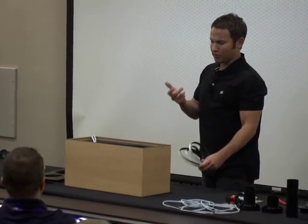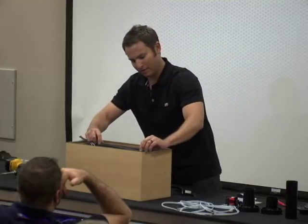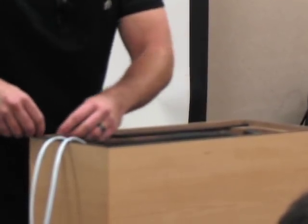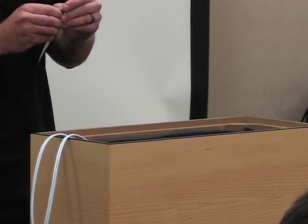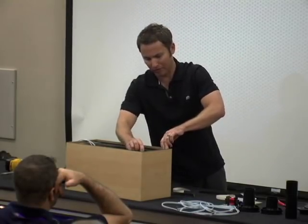Next step is to install the front baffle. We're going to use foam tape to seal it, though I like weather stripping caulk — load it in your caulk gun and it doesn't set. We need a good seal here for the baffle. An air leak in a cabinet can really throw off the tuning, particularly in a ported enclosure where you're relying on the tuning of the port tube. In a sealed box an air leak is less detrimental, though a good enclosure shouldn't have any leaks.